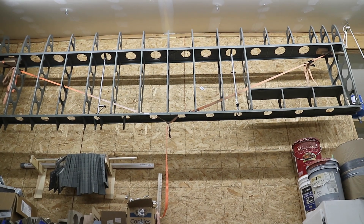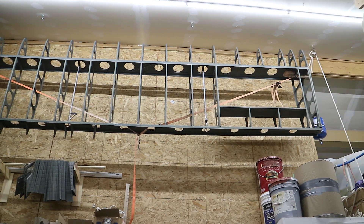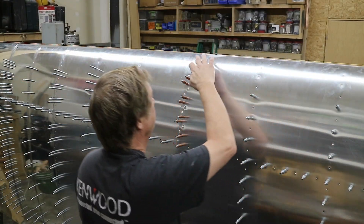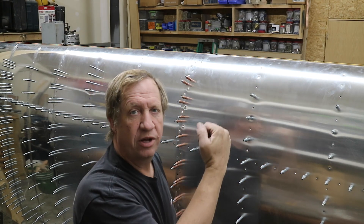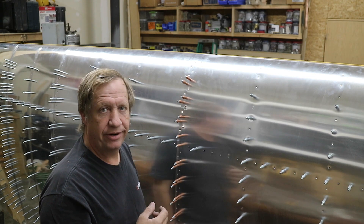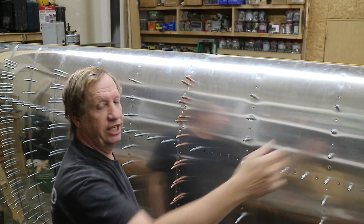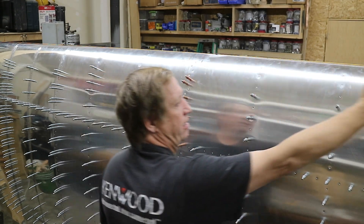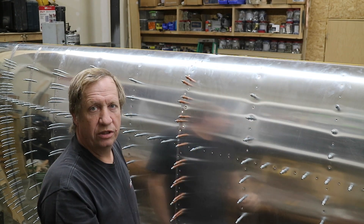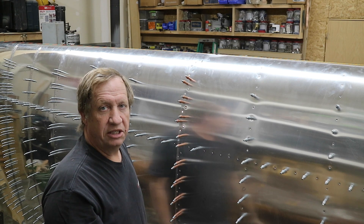It's the right wing up in the ceiling still, and it's not nearly as ready to rivet. So I started riveting the wing skin. I've got a couple rows done, coming from the top down. Seems to be quite a few different theories on how to rivet it, but basically I'm dividing it up by skins — I do this side, that side of the skin, and then I do the in-between ones, all the way across, then move down to the next row. Seems to be working okay.